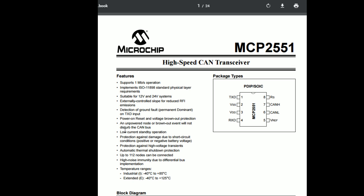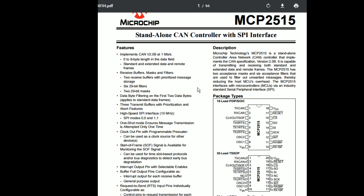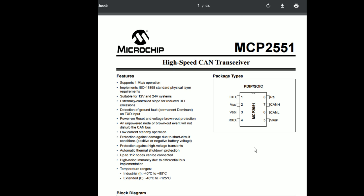Here's the CAN transceiver I'm using. If I make a CAN-only version of this I might go back to through-hole and make it a kit for Tindie. This is a CAN transceiver - not to be confused with a CAN controller, which is a whole processor-level thing. This one augments a processor and speaks SPI, providing the correct electrical interface to the car. ESD protection is essential - you need to protect these devices from all the crazy voltages in your car, and from accidentally sending strange commands that could cause it to stall.